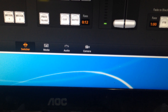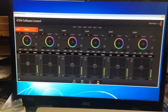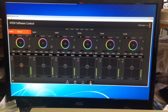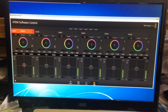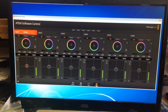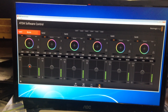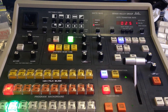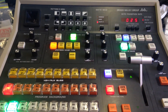If you go down to the camera icon and click on that, it will show you six camera CCUs, because there are only six inputs. You can have cameras on there — mainly the Blackmagic Studio cameras — but I'm also working on an interface to use this same control both on the software control panel and on the GVG to control third-party cameras, whatever features they have available.